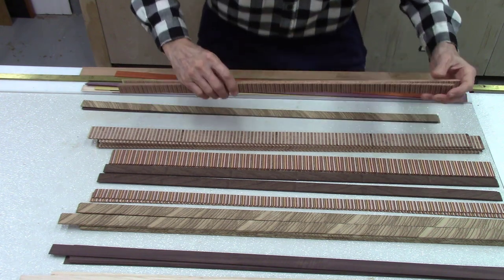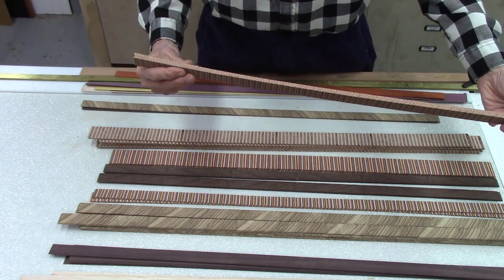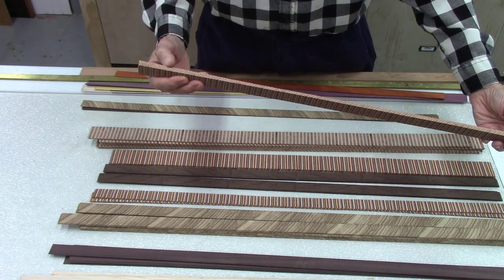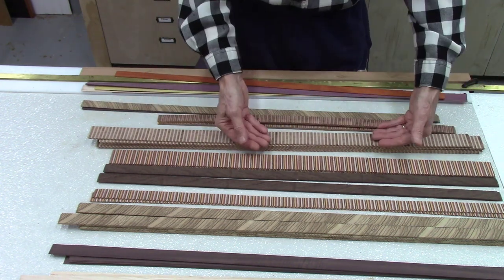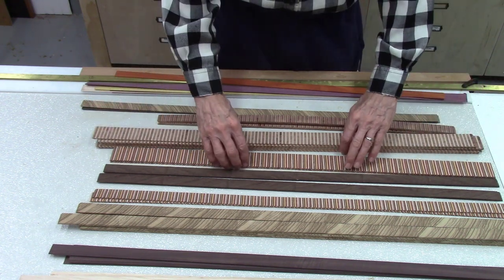The reason I made these wider strips is that when making a herringbone design and I want those patterns to line up exactly, it's pretty difficult to get them to be exactly perfect. The easiest way is to create a strip and then cut it down the middle, then fold the two halves over on top of one another — that has the best chance of perfect alignment. Any little change in the glue angle, how tightly it's glued, or inconsistencies in the widths of the pieces can create patterns that won't match up. So by making these strips, cutting them in half, and folding the two halves over each other, they'll be more accurate.